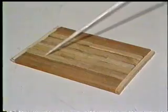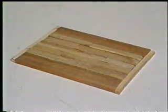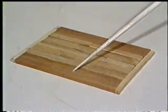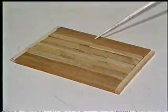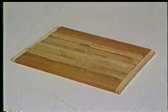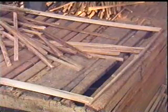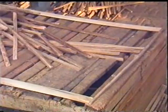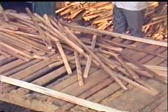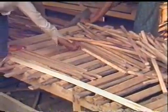Core is the assembly between the face panel and gives support to the outer veneers. Longitudinal edge strips help to give finished edges to the board. Initially, a solid frame of strips is made. Seasoned strips are placed to fill the wide gap in this solid frame.